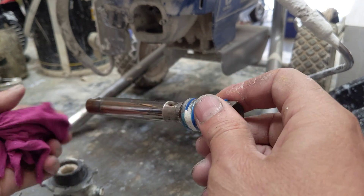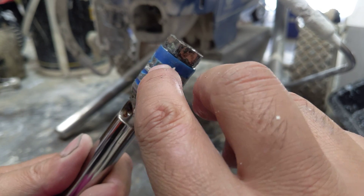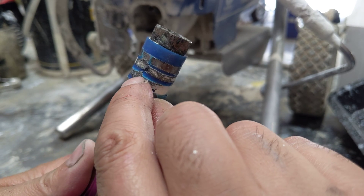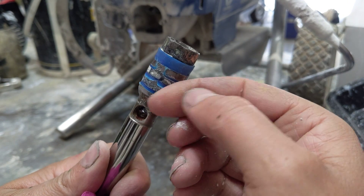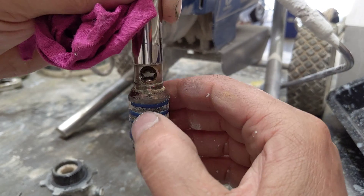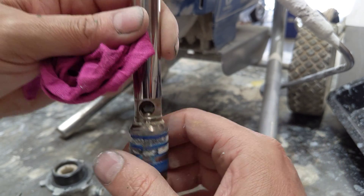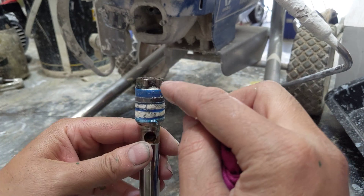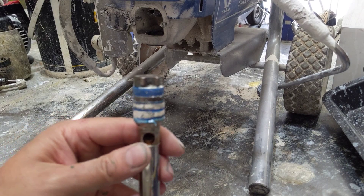I've cleaned the bulk of the paint off. Now you can see this piston rod here — it's actually damaged right here in the packings. You can see it from the way it's sucked up and the shape. This shape tells me that something from the outside has damaged it — something that comes in behind the packings and damages them from the inside. I can tell just by the groove that on the upstroke something — usually a bit of dry paint from the filters — has gripped and been slowly eating away at that packing. The piston itself appears to be in good condition, but there's two parts to a piston rod. There's also another section that sits under here, and I'm going to remove this packing kit and show you what that looks like.